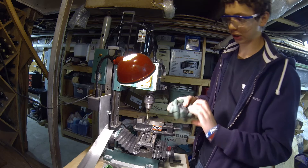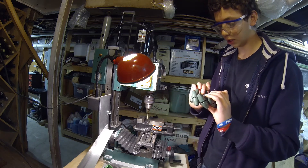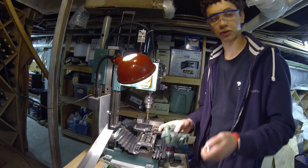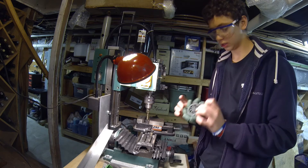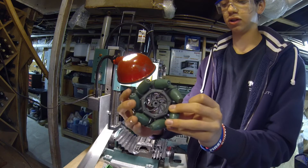It's important to note that they're only centered on one side and not on the other side. So if you want to make a set of VEX mecanum wheels, you have to be careful which side you drill from, because there's a specific way the wheels have to face. Notice the difference — not centered and centered.